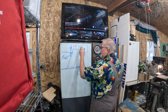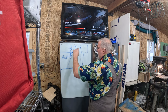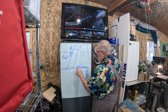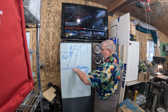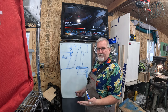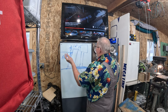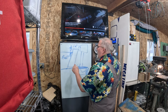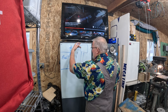And I went up 3 inches over. What I'm going to show you is a long shaft version hanging on my jack plate. And I've got it so that this cavitation plate is literally going to be about an inch and a half below the bottom of the boat, which is fine. But like I said, if you can find it, point me to it in the comments below. What should this all be?